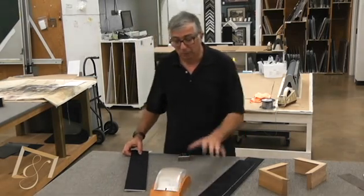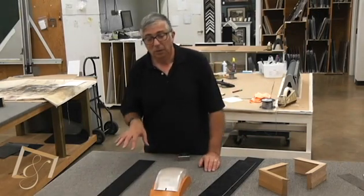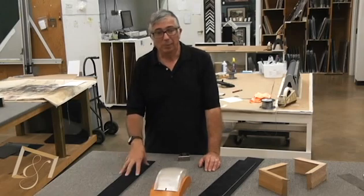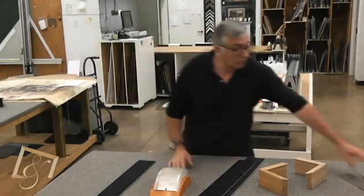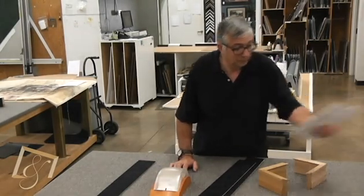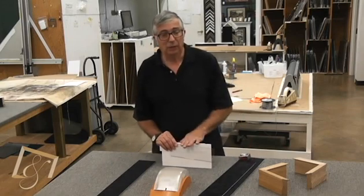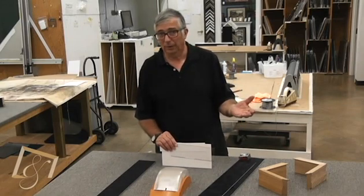You also got to remember when you're talking about a shadow box, you got to consider the glass, the foam core that's going behind it, and the mat board that's going behind it too. So if I took those three items together, it's just over 1/4. It'll be 5/16. So you know you're going to have to add at least 5/16. I would add another 1/4 inch just to be sure.